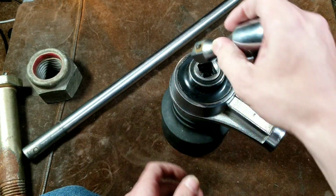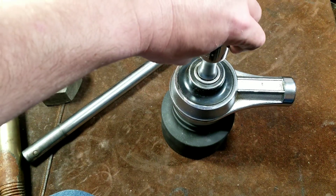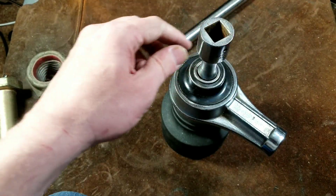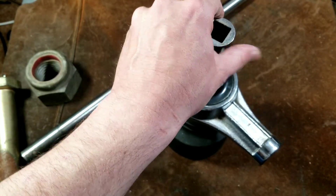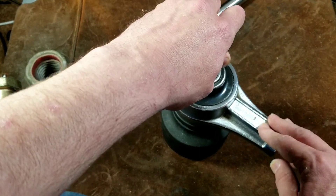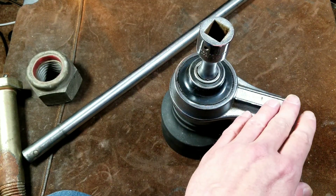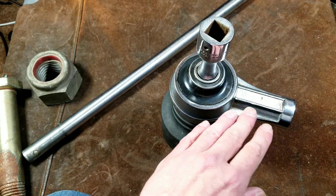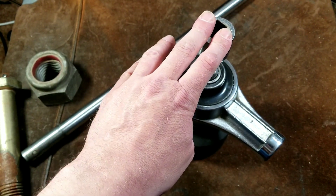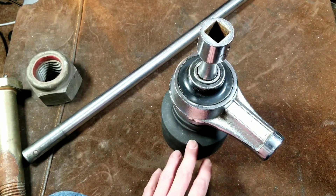I'll show you the reaction: when you turn this clockwise, the handle moves counter-clockwise. That's where the counter-action is happening, so you have to be real careful. A common mistake is to hook up a torque multiplier without it properly braced and have it swing around when you're putting a lot of torque, hitting against some part of your body — it will be pushing really hard and you can really injure yourself. Another issue is that if you're using a breaker bar and can't break the fastener and need to release tension, it's a gearbox and you need to release it nice and easy. If you just let go of the wrench, it can snap back with an absolutely massive amount of force and speed.